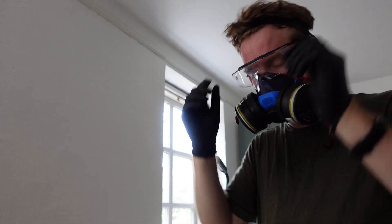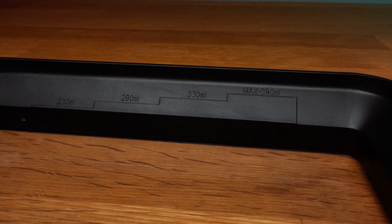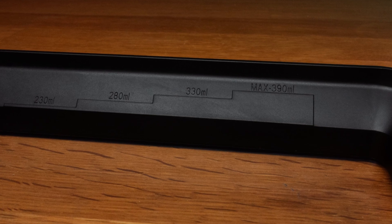I go to the entrance of my printing space and I put on my mask with my organic filter, my gloves. My safety glasses are not that relevant right now because I'm just going to go in and hit print. I go to the printer, open it up, and I check the vat with my silicone spatula for any debris or bumps in the FEP. I also glance at the build plate just to make sure there's nothing left over that will smash down on the screen. I eyeball how much resin is left in the vat or check the indicator on the tank to see if I need to pour in some more.